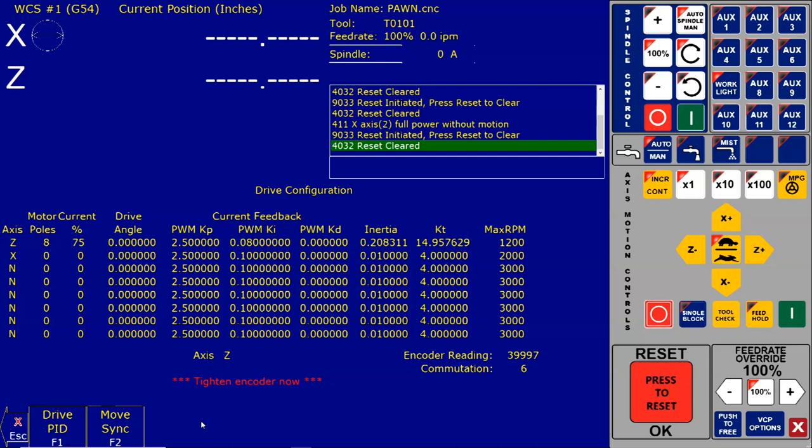And lastly, it says loosely tighten the encoder cap onto the motor. Be careful placing the encoder cable in the end cap. If the cable is causing any strain or pushing on the encoder, it will twist the encoder out of alignment. That's not a problem on this one because the cap is quite huge, so I'm not going to put the caps back on them. After it says reboot the drive and control system, so I'm going to go ahead and do that now.